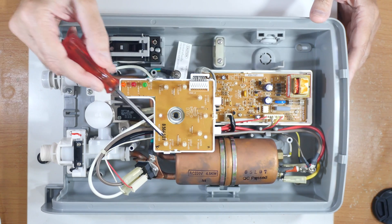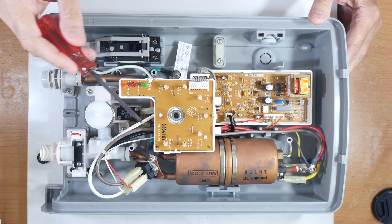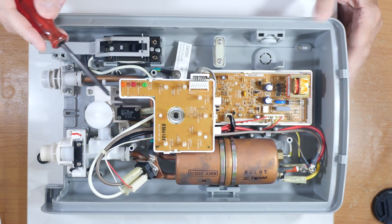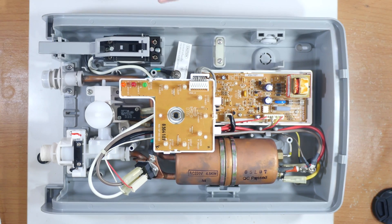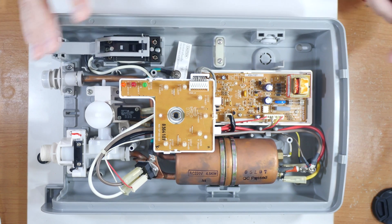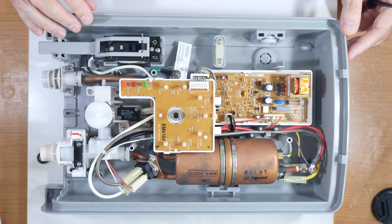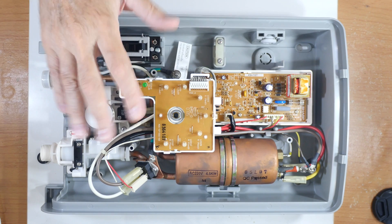The rest of the board doesn't have a lot to explain — there's no microprocessor, this is just good old-fashioned electronics. It keeps track of electricity coming out of the thermistor and regulates the temperature to the tank. It also controls the LEDs for user information, but that's about it. It's kind of low-tech, but I personally prefer low-tech because you don't get all the weird problems. That's it for how this water heater works — I hope you found it useful and interesting for your home DIY projects.